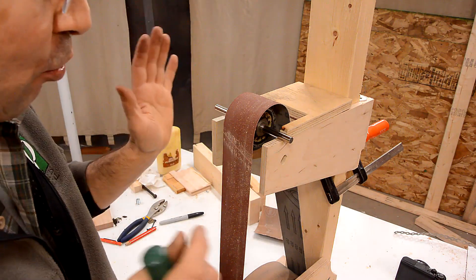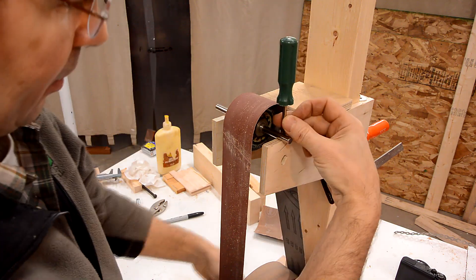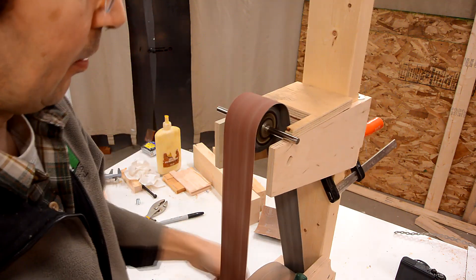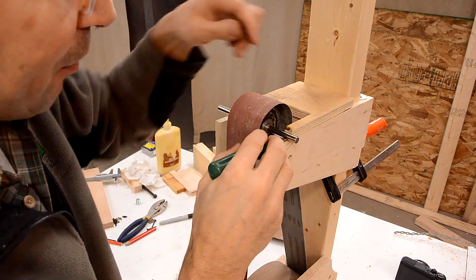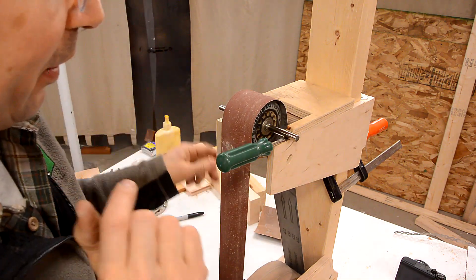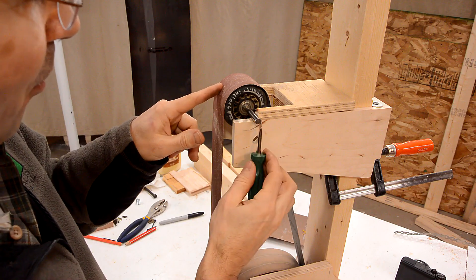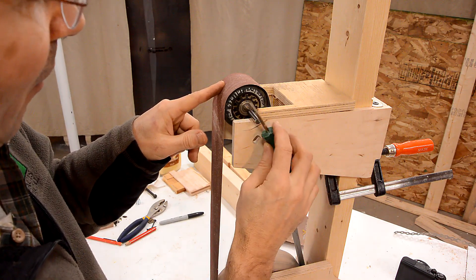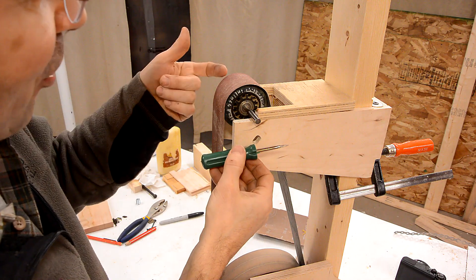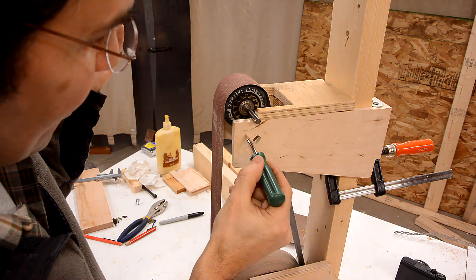I think I know now why my tracking isn't working very well. If I take this end of the shaft and move it forward by putting a screwdriver behind it, that makes the belt track this way. And if I lift this side of the shaft by putting the screwdriver under it, that also makes the belt track this way. So basically to move the belt away from here I either have to lift it or bring it forward — ideally both. But this slot goes this way, so I'm lifting it making it track away, but I'm also moving this end back making it track the other way. So they cancel — the slot is the wrong direction.